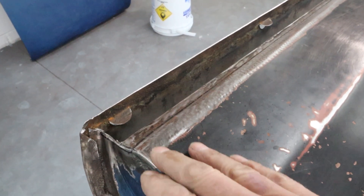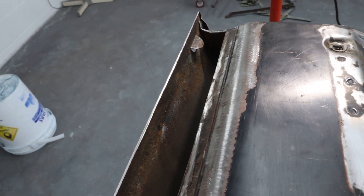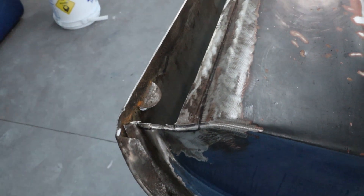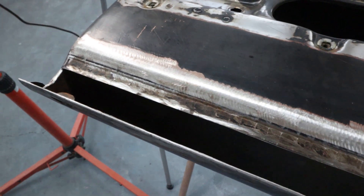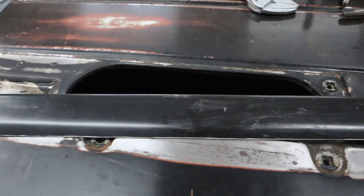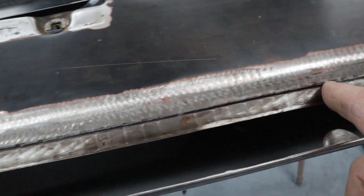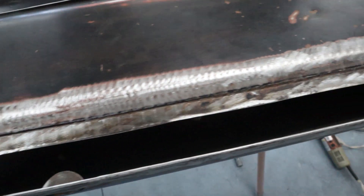Let's take a quick look at the inside skin here. As you can see, it looks really good — for as rusted out as the inner piece was, it's really hard to believe that skin did not rust. We've got a little bit of rust down there and I'm going to take a wire wheel, jab it down inside there and get that cleaned up real good, blow it out. Then I'm going to get some rust conversion on a brush and brush it down inside there the best we can, to get as much protection as possible so we don't have to worry about the outer skin. I'll probably paint the backside of this a little bit heavier coating on the patch panel too. Once we get this all ground nice and smooth, I'll use some spray-on weld-through primer and let that dry real good. We'll do both sides and then we're about ready to start fitting up and clamping for welding.